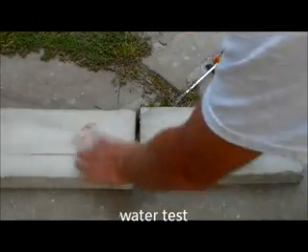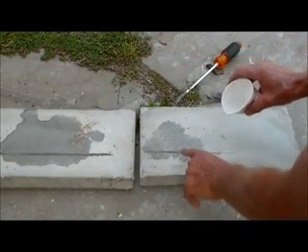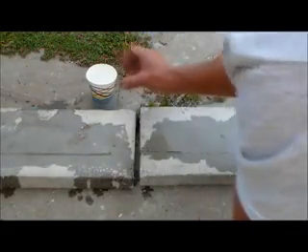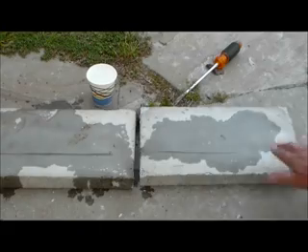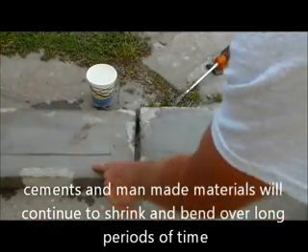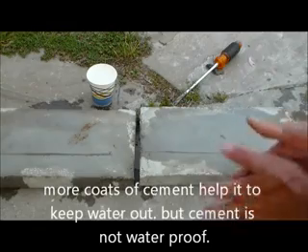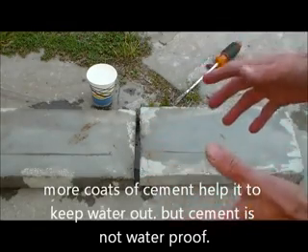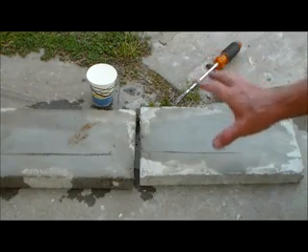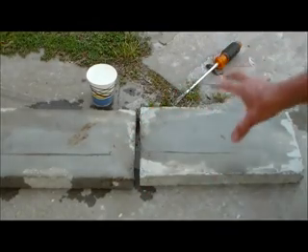Now this is the water test. We have the mortar here and the Portland here. We drop water on it, and you can actually see the cracks in there because cement shrinks and it forms into mud pies — that's the water getting in there. Mortar absorbs water and Portland absorbs water. Don't let anybody tell you that cement is waterproof. What they're talking about is hydraulic cement — it means it will dry underwater. When you add water to cement, it reforms back into the same molecules. If you're going to use cement on a swimming pool, you'd use Portland, not mortar. Highways are made out of Portland.